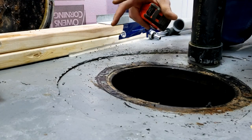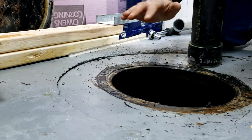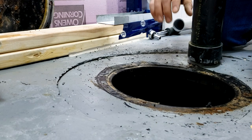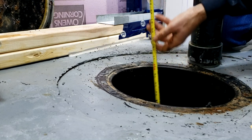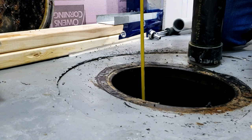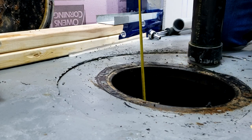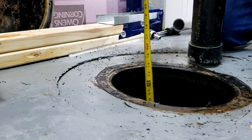Before dropping in the new sewage ejector, we're going to prepare it and take some measurements. We want our pump outlet to pass beyond the floor level straight up, and we're going to leave a little bit of extra room to apply the union connection and the valve and check valve assembly. Going right to the bottom of the pit, 36 inches will suffice — so our piece of pipe is going to be 36 inches, and we're going to prepare that before we drop it into the sewage pit.